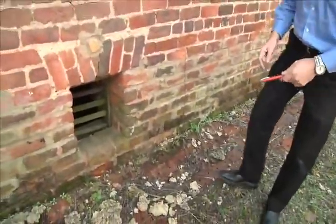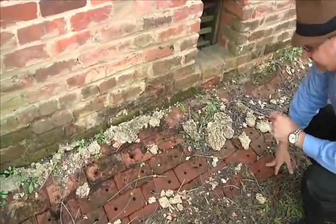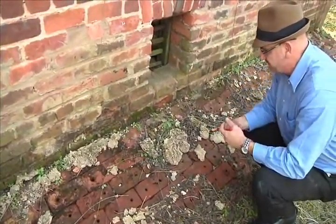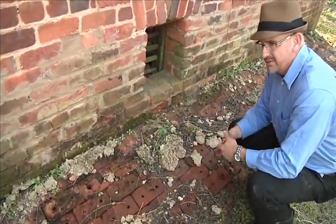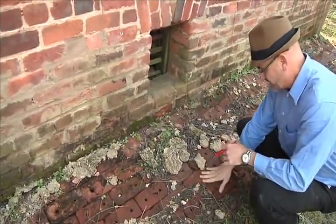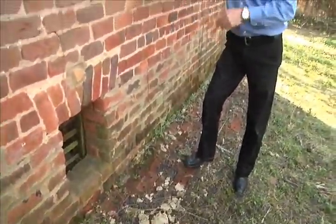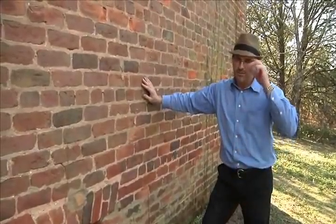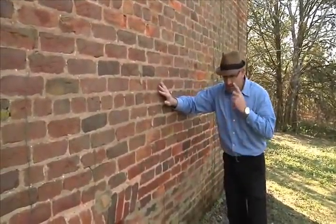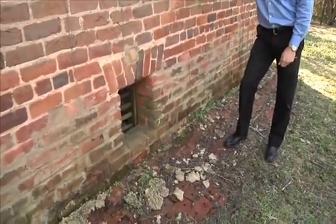What about this brick here on the base? This was done as a French drain to protect the building, because it doesn't have gutters — it was to keep water from getting into the basement. I know exactly where they got this detail. This wasn't common in Georgia, but in Williamsburg those houses all had this brick trench around them. There it was more of a trough, a gutter. So they got this idea from Colonial Williamsburg, but it was not vernacular to this area. It was probably done in the 70s — this is a 70s detail.